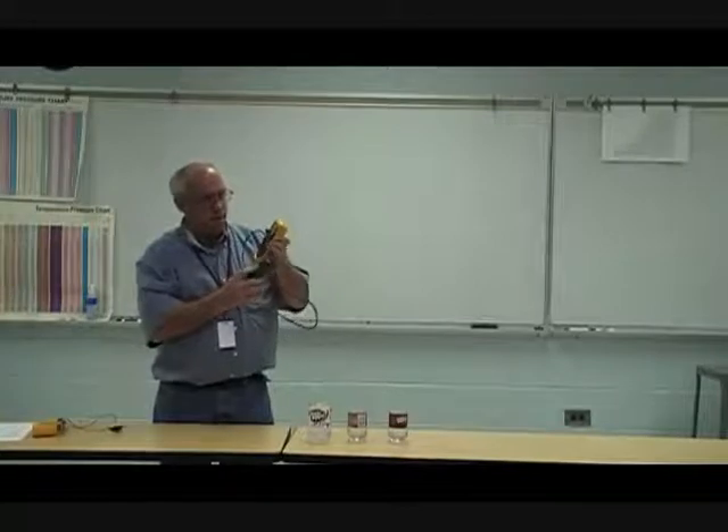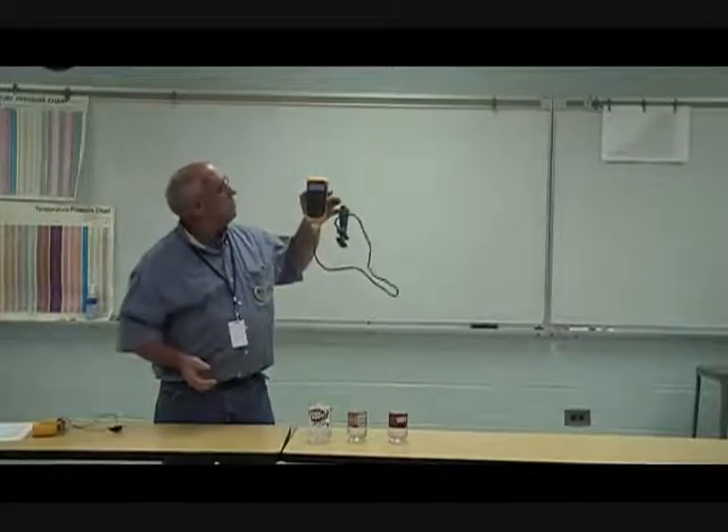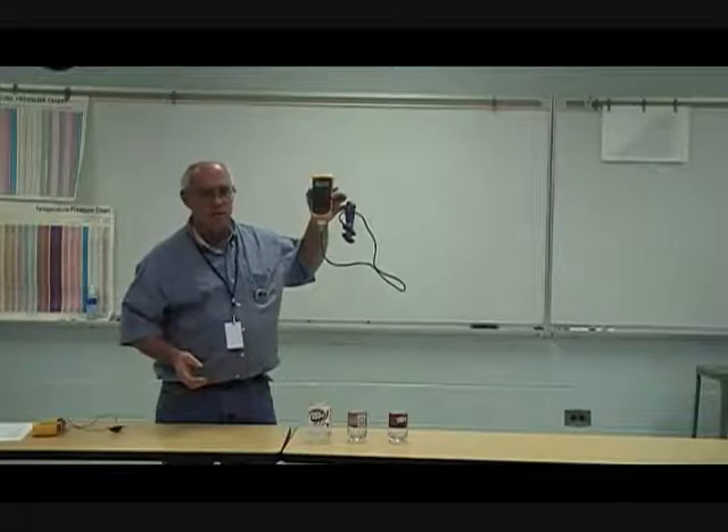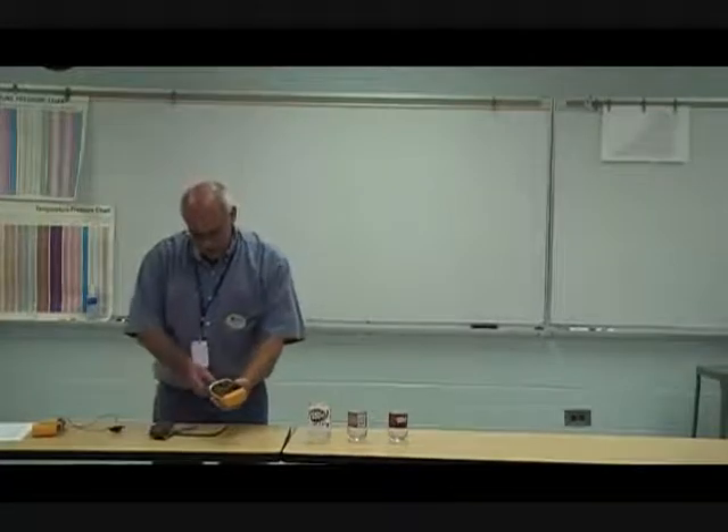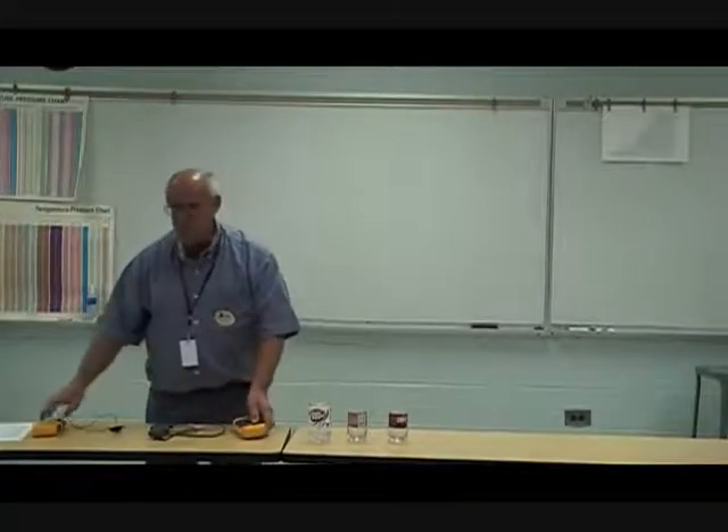You can see that this pipe clamp thermometer will actually fit around the pipe — see it going around my little finger? There is another instrument that is quite popular in our field but is misused: the infrared thermometer. We see the little dot, but that's not what it's measuring. This actually measures the infrared that is being emitted or transmitted from the object. It doesn't send a signal out and reflect back like a lot of folks think — it's actually just measuring the infrared that comes from the surface. The dot is just a pointer.